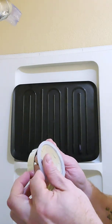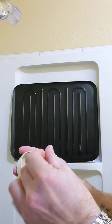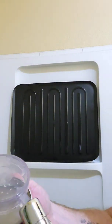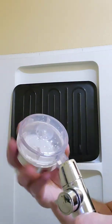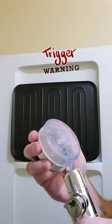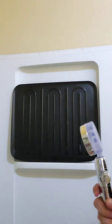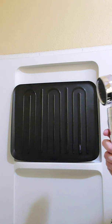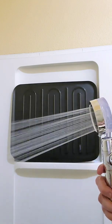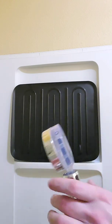Let's do that. Let's pop this out, take this seal, turn the plate around, put the seal back, and we'll screw it back on. Now if my theory is correct, we should get straight water. That is why it spins — because the holes on one side of the plate are drilled at an angle.